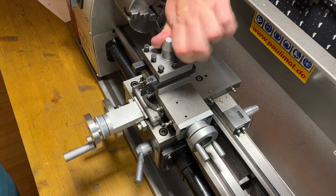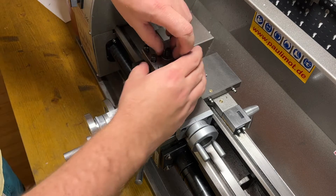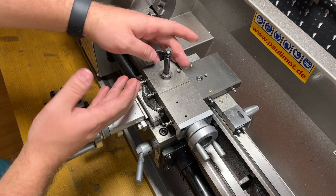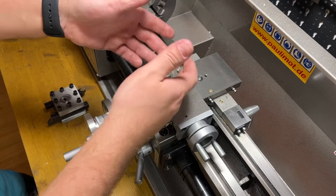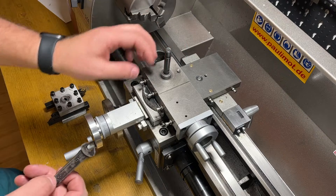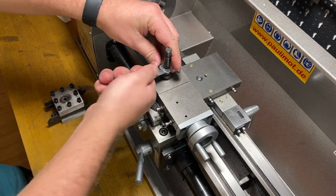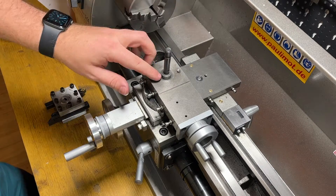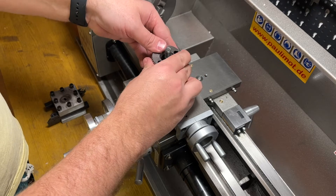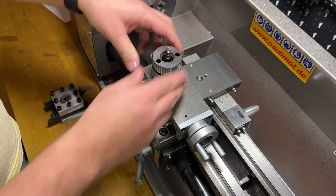Let's have a look how to mount it. Usually on the big lathe, on the compound slide, you have a T-nut or a place for the T-slot, and you just use a big T-nut to mount the tool holder. On this small lathe, construction is a little bit different. This post is part of the compound slide and there is just the screw. This post size should be the same as the hole in this holder — and yes, it fits. It's a pretty tight fit, but that's exactly what I want.